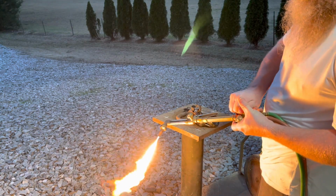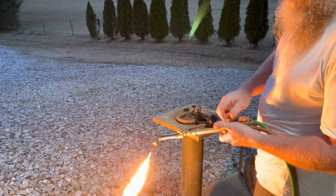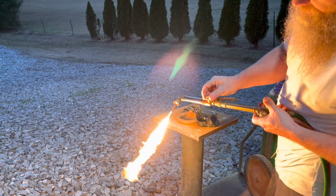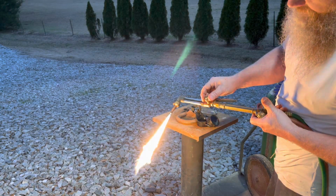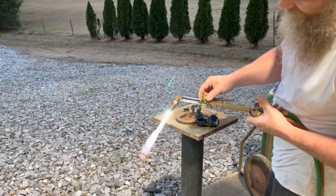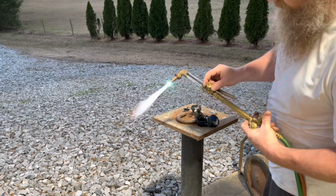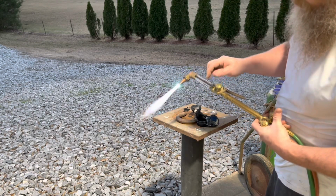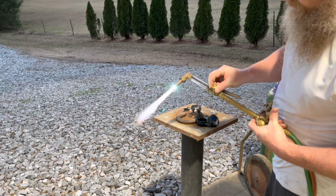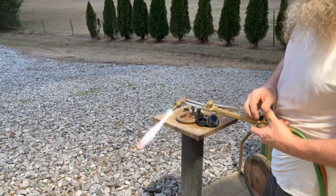And you want to open your, my bad, you open your oxygen down here. You close that one, open this one, you can open it all the way up. And you want to crack that oxygen and pull that flame back until it's tiny, tiny blue flame. See that? Bring it on back till that jet turns into a bunch of tiny little flames. This tip is dirty, so there you go. Each hole has an individual blue flame coming out of it. See that long tip? And you pull it back to individual tips out of each hole. And this one is dirty. You can hear it popping.